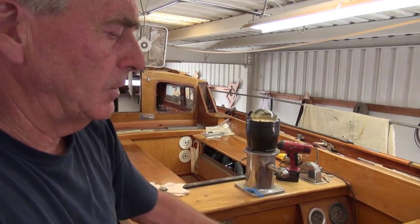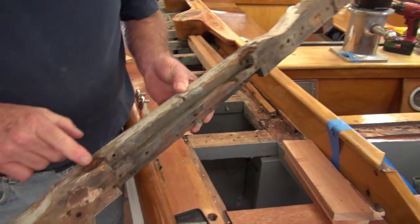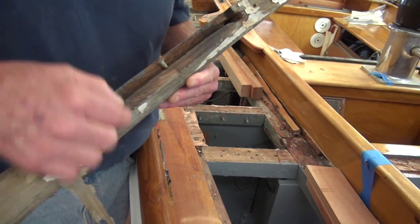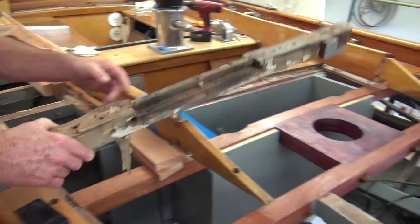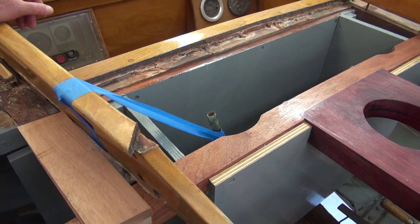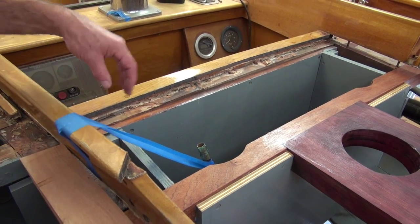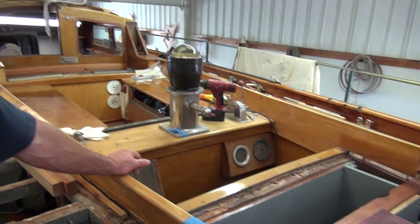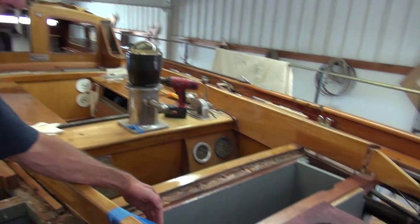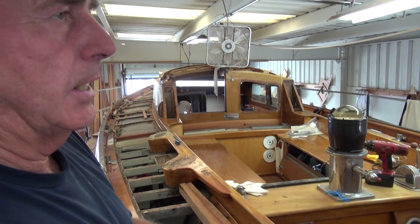We're talking about the propane box. It was added after the deck was on, because you can see this is where the old bolts went through — outboard of the mizzen blocking, which was only that thick and was notched, which weakened the beam. Whereas the slope notch doesn't. They had also cut the deck off here a little short. We're going to blow this out and put a new piece across that's wider, and then our new lid will have planks made out of teak with a slight V-groove in them for traction, appearance, and drainage. The new propane hatch will only be this big — there'll be a margin board here so it's not this massive lid to take off.